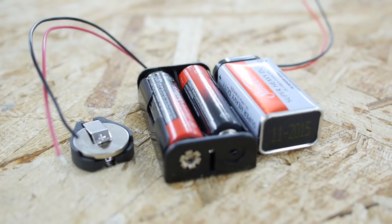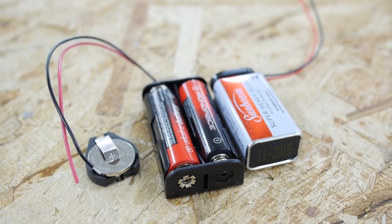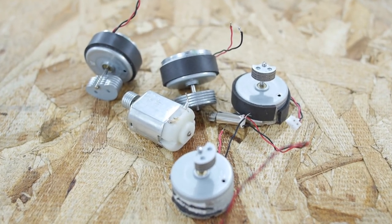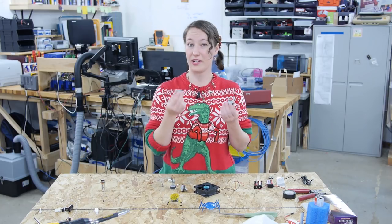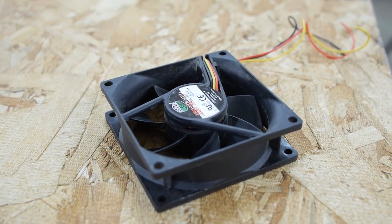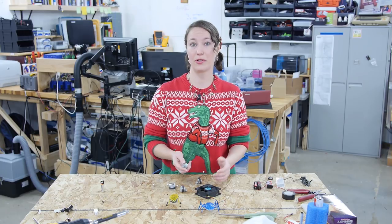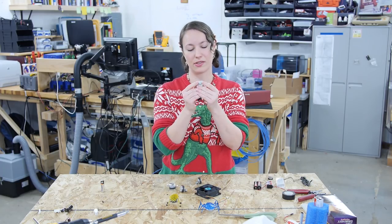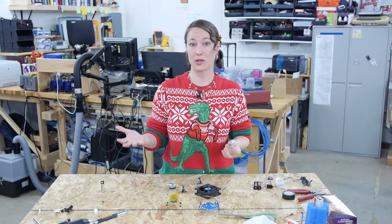All you need to make one of these is a battery and a motor. For our wiggle bots we're gonna be using a battery, which means we're gonna want a DC motor. Here are some DC motors I've found in common objects: this one I pulled out of a cheap electric toothbrush from the dollar store, these are from video game controllers, this one might have been out of a cell phone, and this is a computer fan. This one won't work as is — we actually have to break a few of the fan blades off so that it's off balance. How vibrating motors work is they're just like regular DC motors with a regular shaft coming out of the middle, but a weight is placed at the end so that when it spins it's constantly pushing that weight around in different directions, and that's what causes it to vibrate.